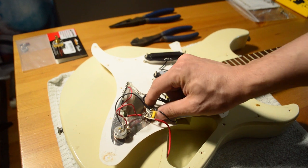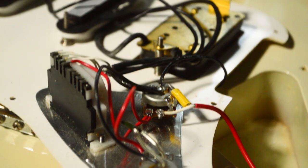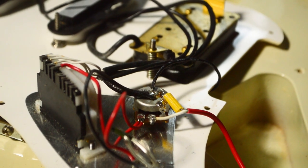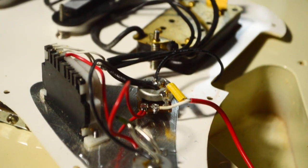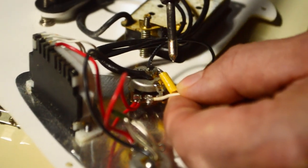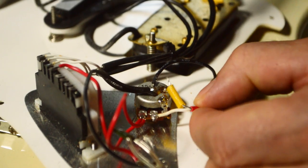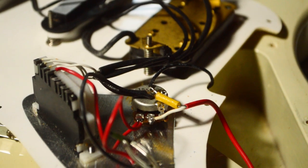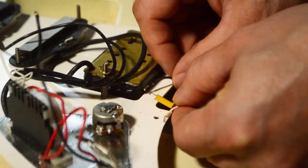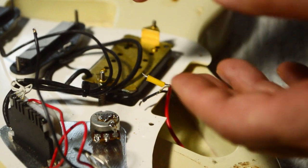You'll also notice that I have left the pot attached. Sometimes if you take the pot off and make it loose it's just going to rattle around and make your job more difficult. Now if you're new to soldering, you may want to defer to someone with a little experience and ask them to teach you. I do have a video on how to solder — you can find that link in the description. Being very careful and going one wire at a time, apply a little bit of heat and remove the wire from the pot. Be careful not to touch other wires so you don't melt the shielding. With all the wires removed, I've pulled them and left them in the places where they'll go, giving me a clear area to remove the old pot and install the new one.